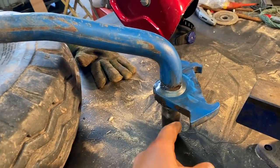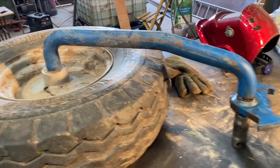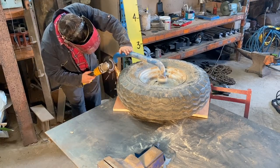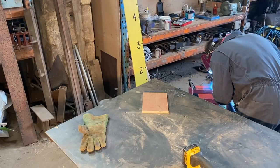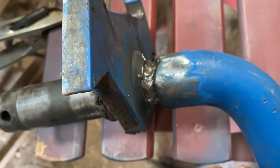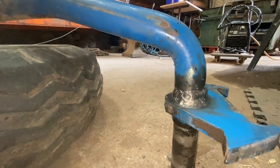Taking a few measurements to try and square it up from this point, back here, and the same on the other side to make sure it's square - that direction to the wheel. I'm just hoping the fact that the end face is flat and I've got this wheel flat on the ground will keep that relatively in line. But I've not got much hope in it surviving to be honest. I tried to get as deep in there as possible with one wee weld all the way around, and now I'm going to completely fill all that in. I've cranked the power up and the wire speed up as well, so hopefully got a nice big hot weld in there. That's it - welded all around that seam.